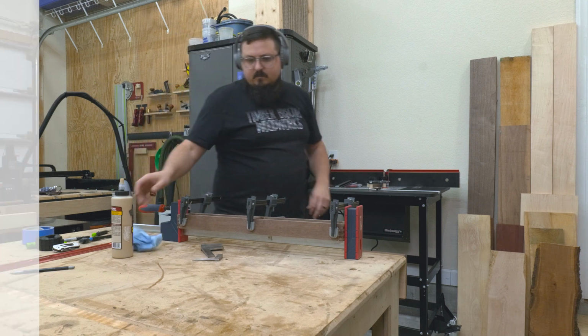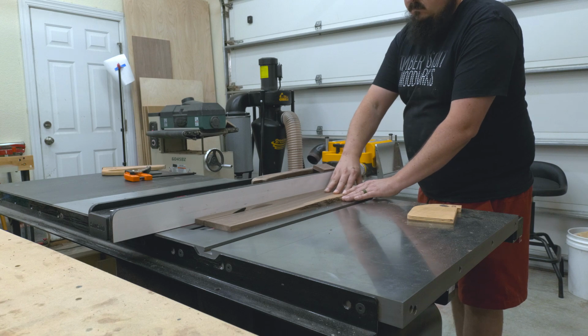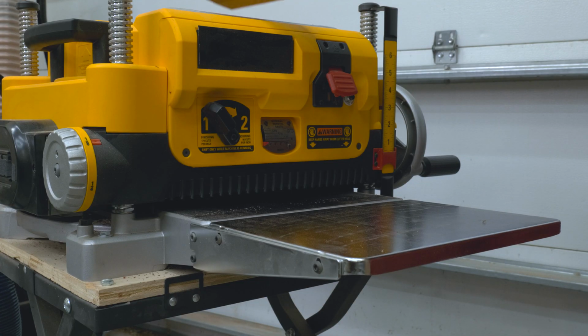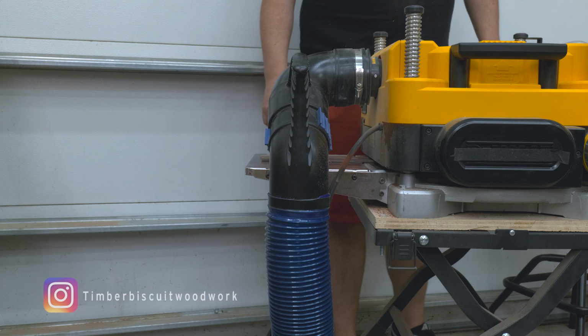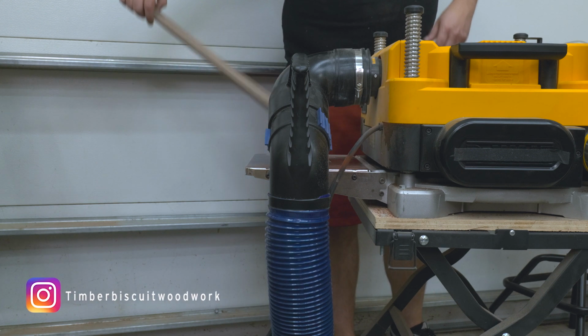Alright, so while this towel rack hangs out to dry, let's get started on the tongs. So to get started, I ripped down 2 strips so that I could create my tong squeezers, or grabbers, or whatever you call them. So once I had my 2 strips cut out, I ran them through the planer to thickness them down to 3/16 of an inch. That should give them enough rigidity for a good sized tong, but if you go with a super long set, they may weaken a bit.